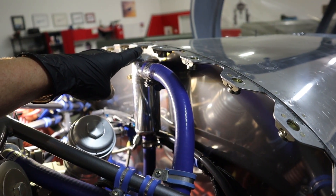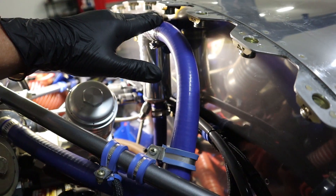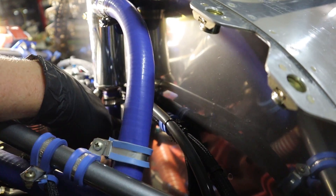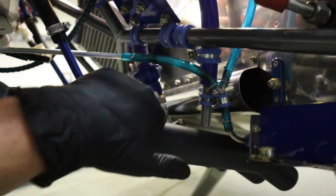On the top of the engine we have the oil collector. The breather line comes out the back of the engine, goes into the oil collector, then back into the engine through a port, and is plumbed down into the exhaust. That's an anti-splat system, and apparently it adds a little bit of pressure and a little bit of power to the engine.